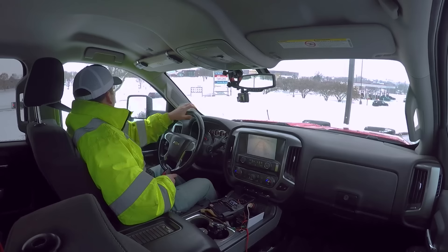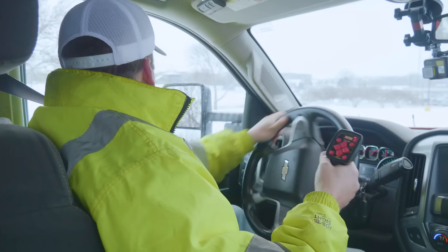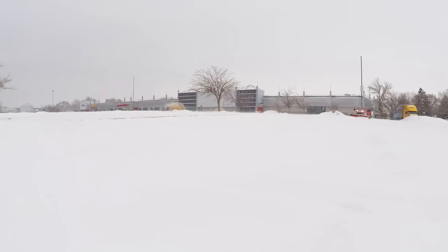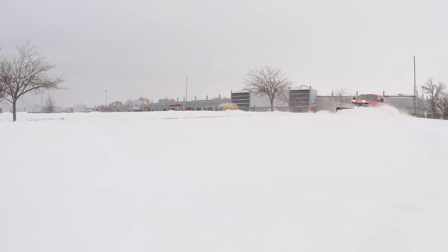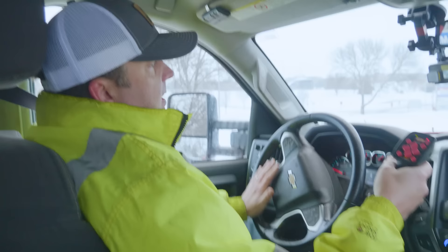After that, you're picking it all the way up and then you're reversing — obviously being careful where you're going, knowing what you're backing into. If you can go in a straight line, that's ideal. As I come back toward the end, I'm going to line back up for my next one. I've got a cleared-out area here. Dropping it back down — I'm aiming with this amount of snow almost putting this right down the center, because we've got a good probably foot of snow here. This is an area we haven't been in and don't keep plowed regularly. At the end, I'm picking it back up. As you back up, even going at half speed, I spilled material off the side. So if you see that, don't worry about it — that's just an adjustment you need to make. I know that I can't do that quite as much on the next one.